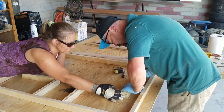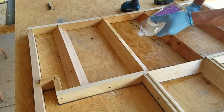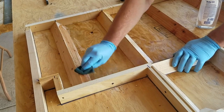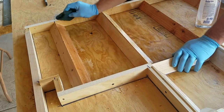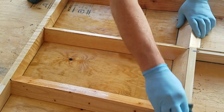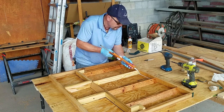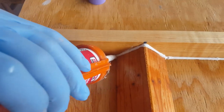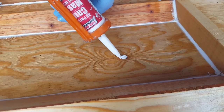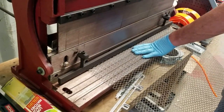We put together the interior portions of the form and fastened them in a similar fashion. I didn't want to spend too much time explaining this form in detail since there are quite a few changes to be made — this was the first experiment. After the interior portions were in, all that was left was to put the wedge dividers in. After completing the form, I sealed it well, applied a release agent to the wood, and ran a bead of caulk along all the joints so the cement would release cleanly. I also filled holes from knots in the plywood.